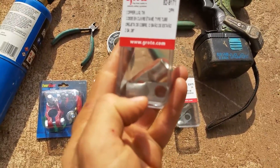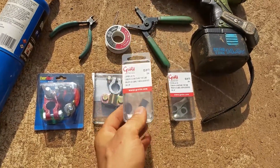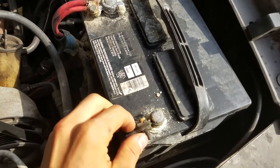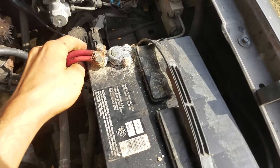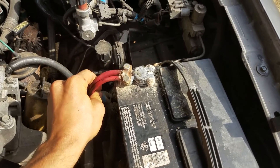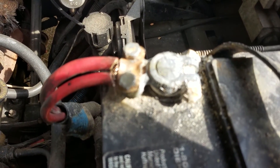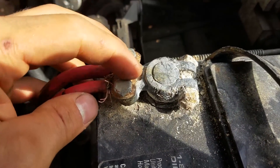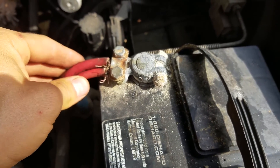You're going to want to drill a small hole on the top so you can solder it. Our battery terminals are absolutely disgusting — there's a crazy amount of corrosion on them. The battery is not charging good and not starting good. This style allows corrosion to wick down in there and causes a lot of problems. We're going to do away with this style and solder our own lugs.